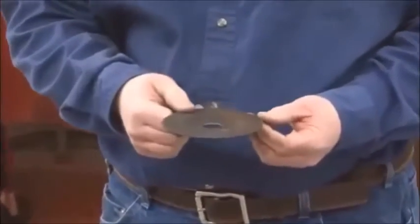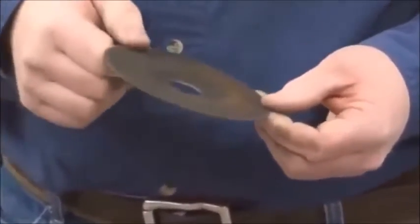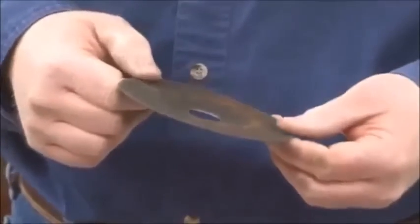This is a cutoff wheel for a 4.5-inch angle grinder — as you can see, it's very thin. These can be used for cutting aluminum; however, you want to be very careful because as you cut through aluminum, the aluminum particles will actually embed in the cutoff disc — you'll be able to see them in the disc itself. When you go to reuse the disc, the aluminum heats back up at a different rate than the fibers of the disc, which can actually force the fibers apart. If that happens at high speed, the wheel can actually explode. So I only use a brand-new disc for cutting aluminum and then dispose of that disc after I'm done.